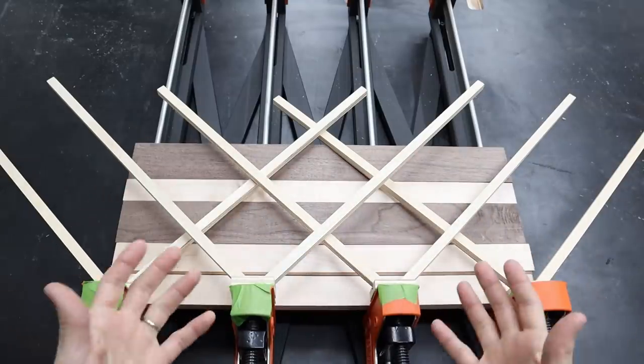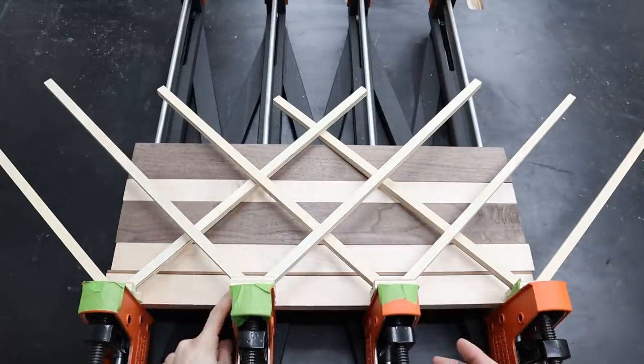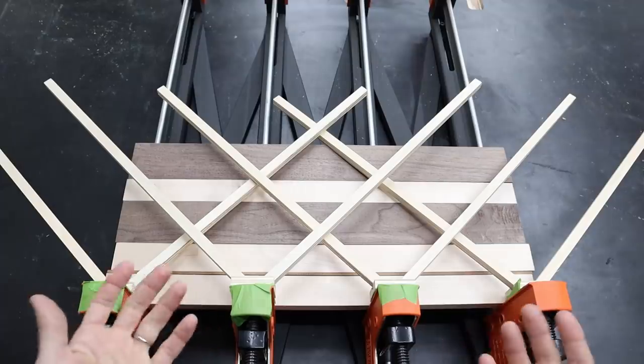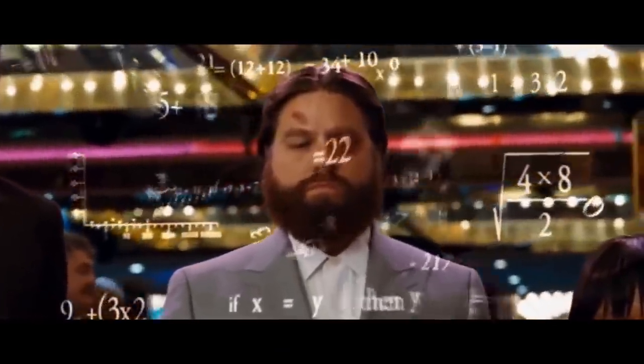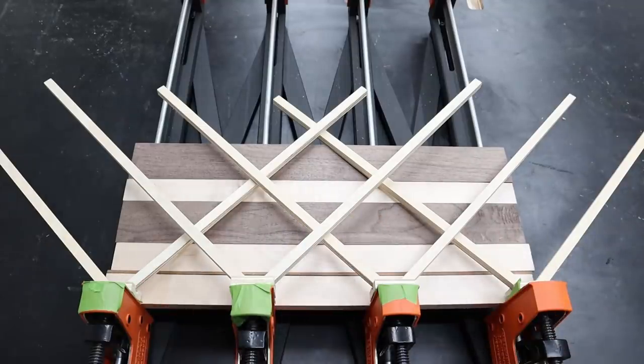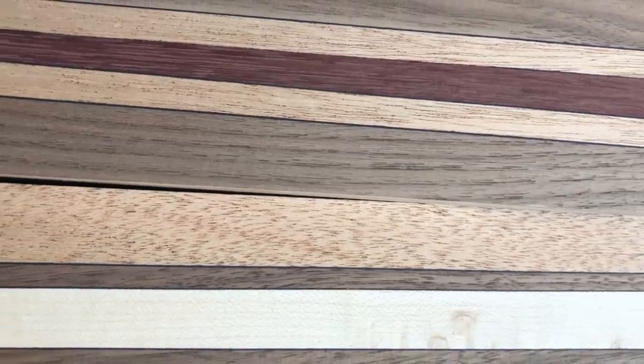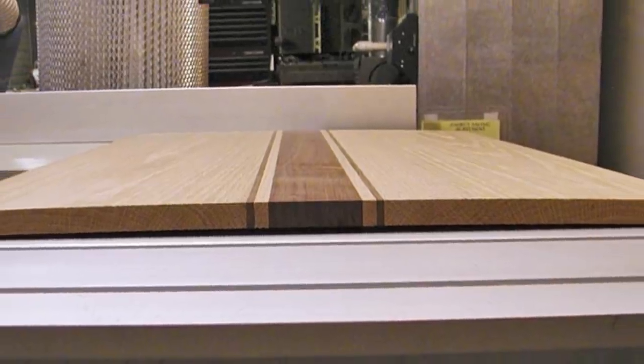The lesson being, the more narrow the boards, the more clamps you need, because the distance from this joint to the clamp face is shorter — in math or something. I would add three more clamps to this glue-up for a total of seven clamps on this cutting board. Chances are you would be fine with fewer clamps, but you do run the risk of these joints eventually failing or applying too much pressure, which leads to cupped panels.